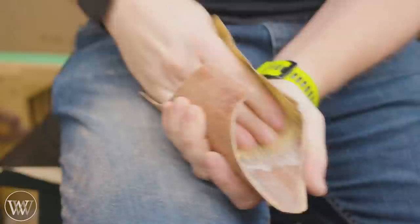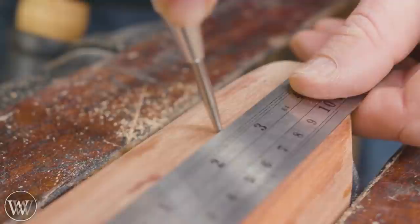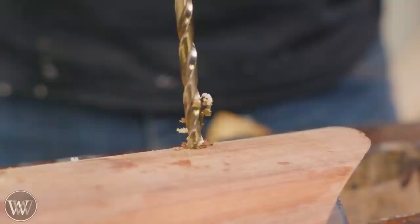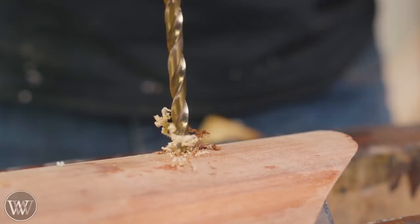Then once we get it exactly where we want, I remembered, oh yeah, we need to drill some holes in this because I want to put the holes on before we put the finish. The holes are 2.5 inches apart, at least on my bike. I don't know if that's a standard. I think it is, but I don't know. So I set out one, then marked the other one a little ways away. They are, if I remember correctly, a 5mm thread. But I can't remember that exactly, so measure your own. So that's how it all comes together. Now we can start working on the finish.